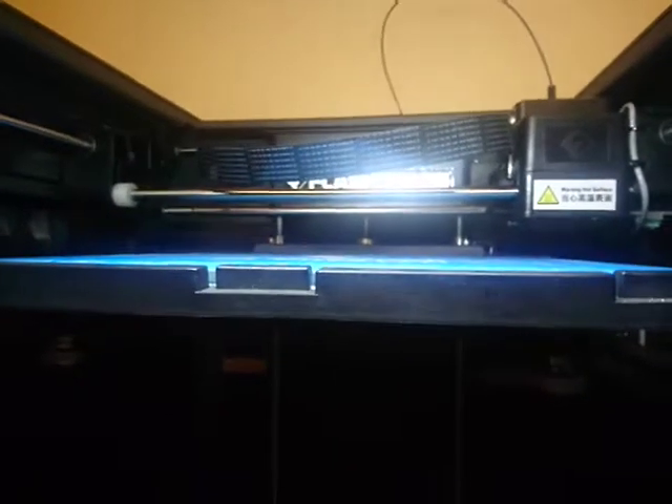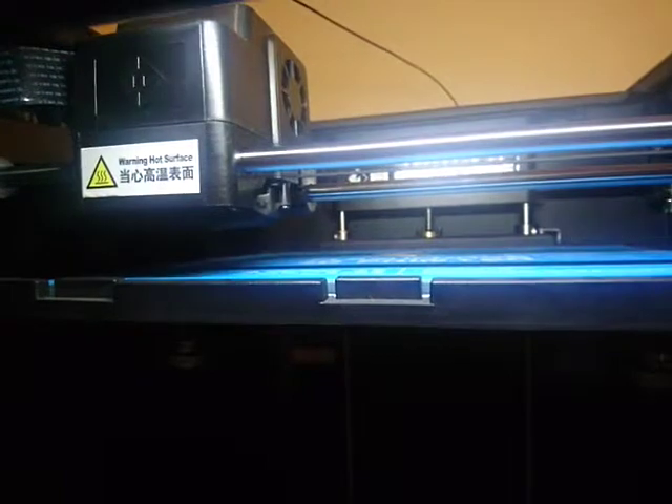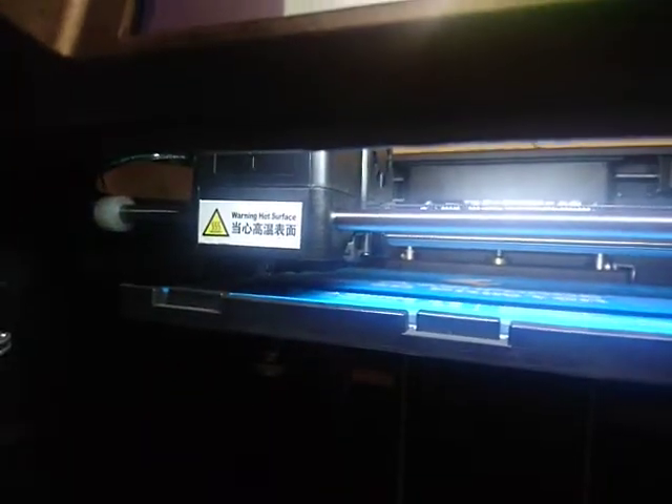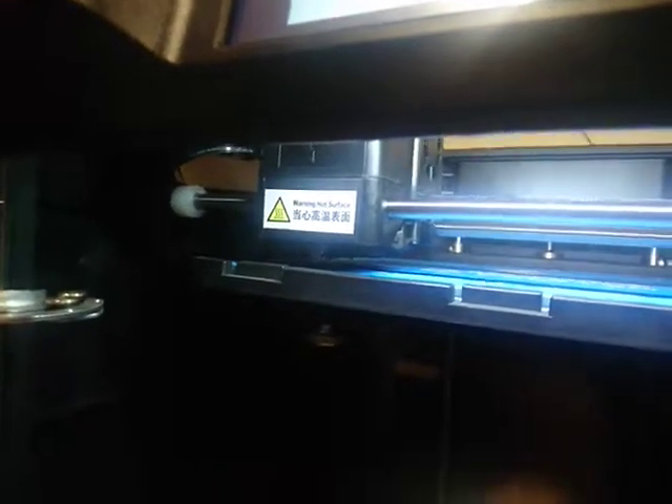We can screw these a bit tighter — I normally just go a couple of turns. But we've changed the sensor so I don't think we need to tighten it at all. We probably have to undo this quite a bit because we just have the standard nozzle on. That was nowhere near the switch, so yes — that has worked successfully. By adding those washers, we've given ourselves about an extra two, maybe three millimeters in clearance. If extra clearance is what you need, that is what you should be doing.